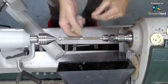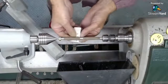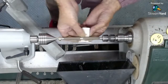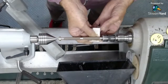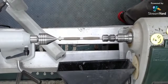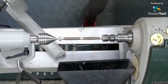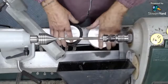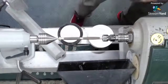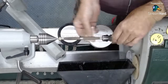Right, just a little tiny bit more off this one. That's the frailty of age, you guys. Shape bends with the 60 grit rather than using the tools. I suppose you could, if you want to be a bit ignorant about the thing. So CJ Obbies has made a good point, something I was about to say to you. Anyway, turn the lathe off and sand lengthwise, with the grain, to get rid of any spirals, any lateral or radial marks.